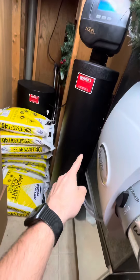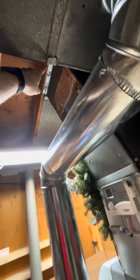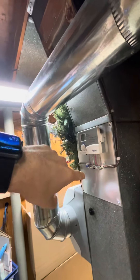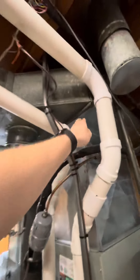One thing to be mindful of — back here we're real tight on this water softener, so I can't really bump out. But you'll notice this is coming down and transitioning back. So I'm gonna bump this return drop forward and scoot the system forward, since we're creating a whole new plenum and everything anyways. I got room to come over and get up there before it starts to downsize. All I need is a really good inch to bounce forward.